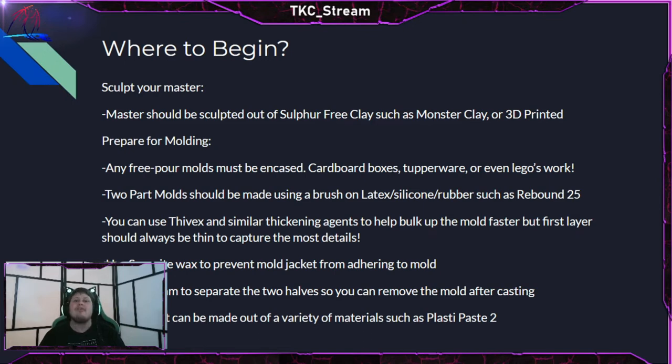Whenever you're ready to cast in the base itself, you'll definitely want to use a mold release. Well, you don't technically need a mold release with a two-part mold, just because the mold itself is so thin and flexible, you can really just pull it out, but this will slowly erode your mold over time, as it will leave microscopic pieces of whatever material you cast in the mold. So a mold release agent is highly recommended.